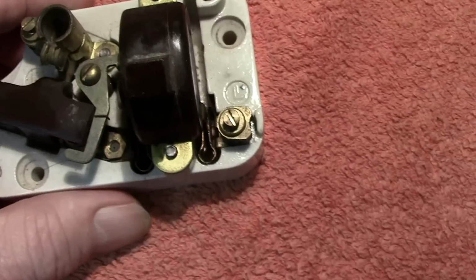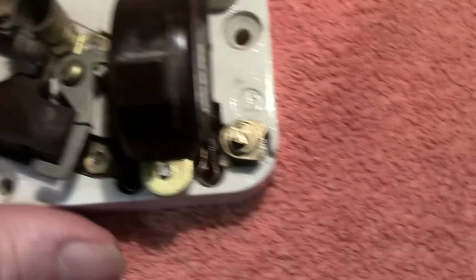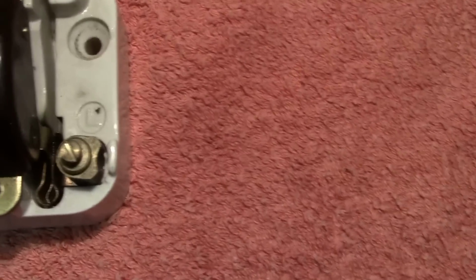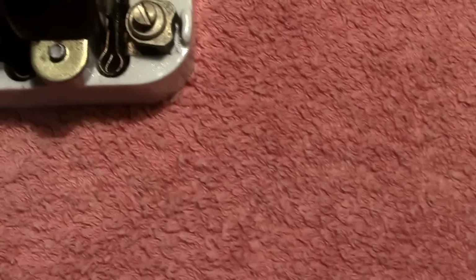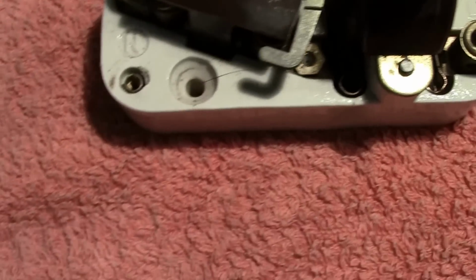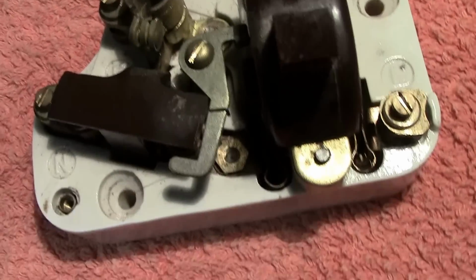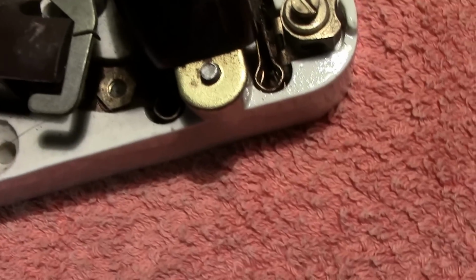Now what's rather interesting is, and I didn't realise it at the time, if you try to put a plug in with the switch in the on position, it won't work. Now at the moment it's on. If you note, you see a little lever there. It sticks out, so I can point to there. That lever prevents the opening of the shielded part to the other sockets.